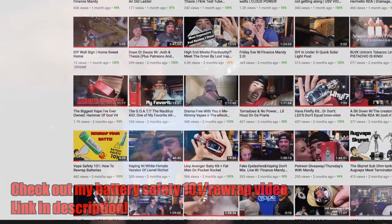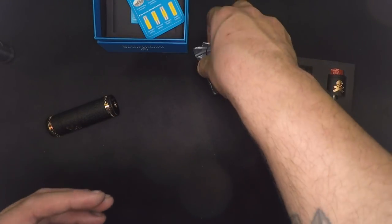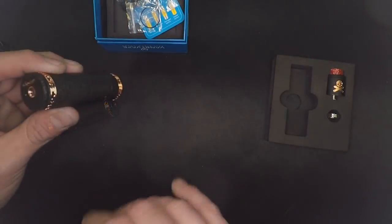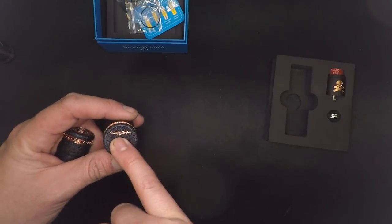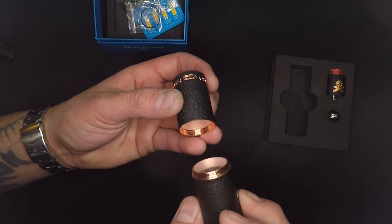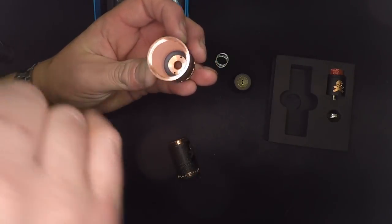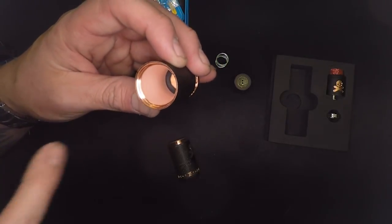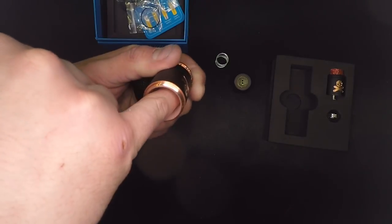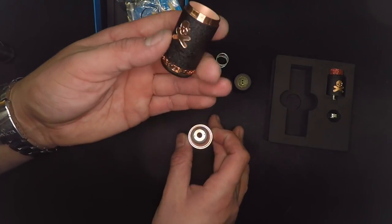You can short out your device and it can become extremely dangerous. Now a quick disclaimer: this is not something I would recommend for a beginner — you could easily hurt yourself if you don't know what you're doing. This is a hybrid mech mod. The battery actually protrudes to the top and that's what makes the connection with the RDA and the coils. It comes with an 18650 adapter. The sleeve itself is a safety feature, as is the Delrin top — that black ring on the inside protects your battery from making contact with the copper at the top and bottom.